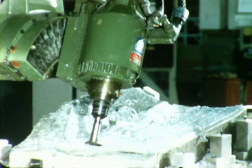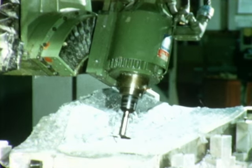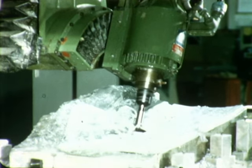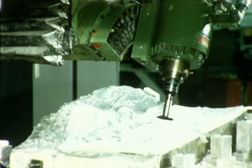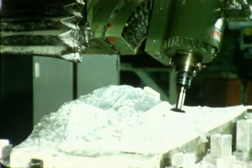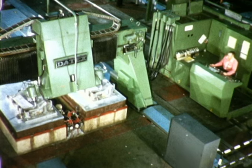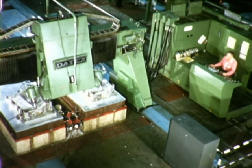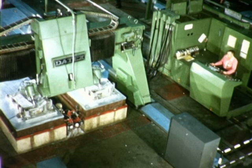The high versatility of the Datex core milling machines, their ability to cut two parts at once, the automatic, semi-automatic, and manual modes of operation, the compound contour milling of complex parts, the ability to program tapes automatically at the machine, all under the direction of a single machine operator, have proven to be important additions to the F-111 manufacturing capability.